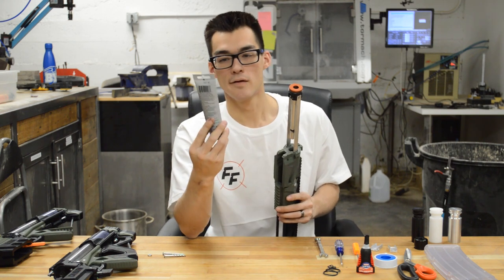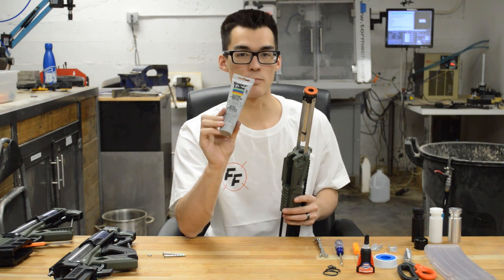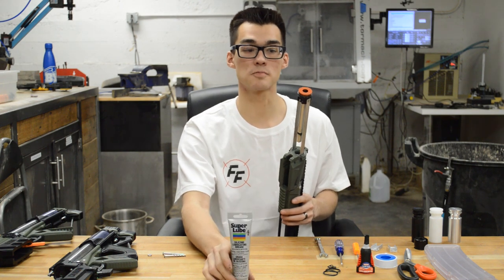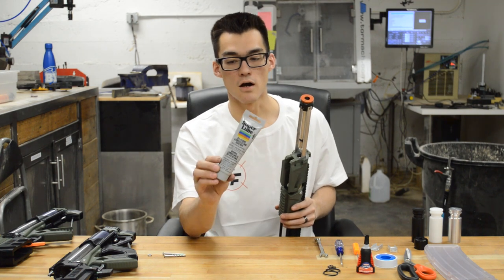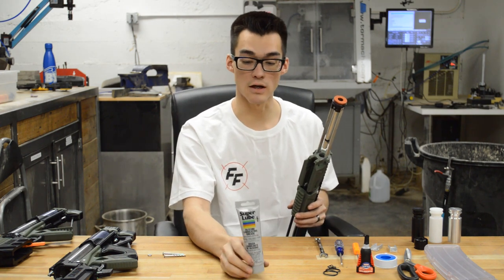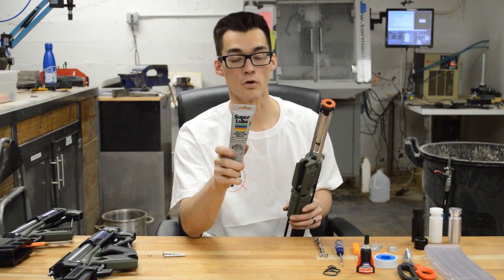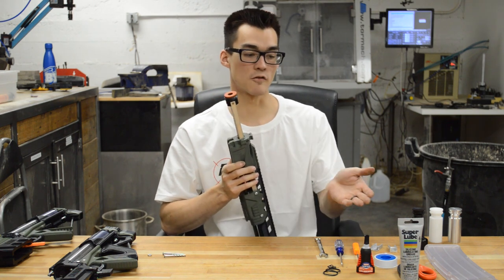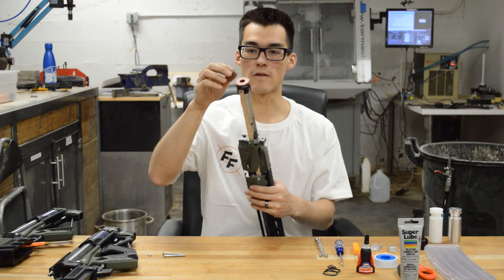You should always use a silicone grease or other lubricating agent that is not petroleum based, because that can deteriorate plastic and some O-rings over time. You especially want to avoid aerosols because they contain additives that also deteriorate your O-rings. You should really only use silicone or other PTFE plumbing grade grease. We like Super Lube, and other plumbing greases all work well. Amazon, Lowe's, or Home Depot will carry some sort of plumbing grease. Go ahead and lubricate the O-ring notch and the O-ring on the base.